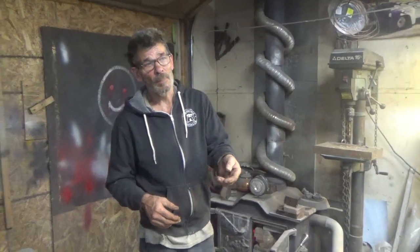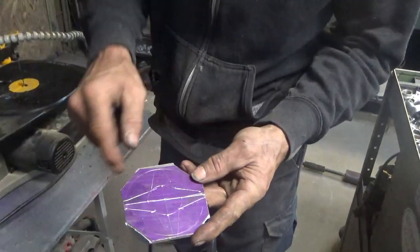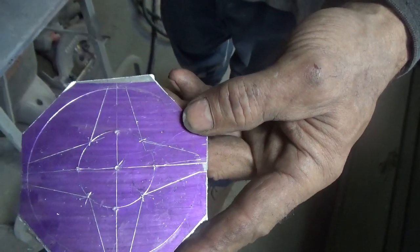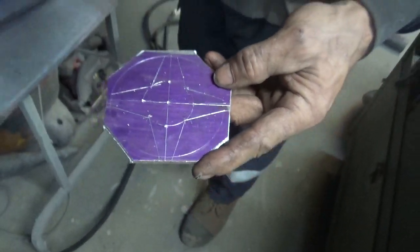Take this glove off. The idea is to create an aluminum tube. Yes, I could buy some — I have not sourced it yet. Pretty much what I need is four and a half OD by about three-eighths thick to create what I'm about to show you. That's just the outer part of the rim. You have to make a center insert that bolts to the hubs. Basically I made one of these yesterday. I drill a hole in the center. These four dots represent the bolt pattern on the rim. You can see I've got it scribed around the outside. I drill the center out, I have a half-inch bolt and bushing with a nut that I put on there — clamp it, throw it in the lathe.